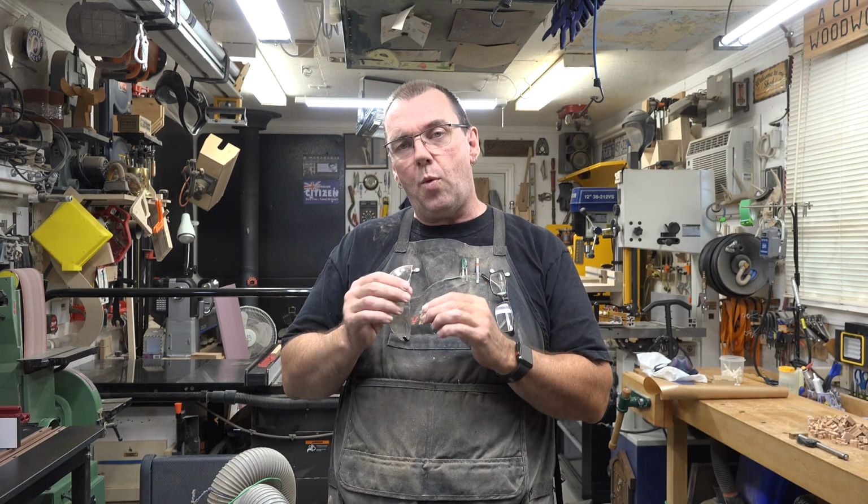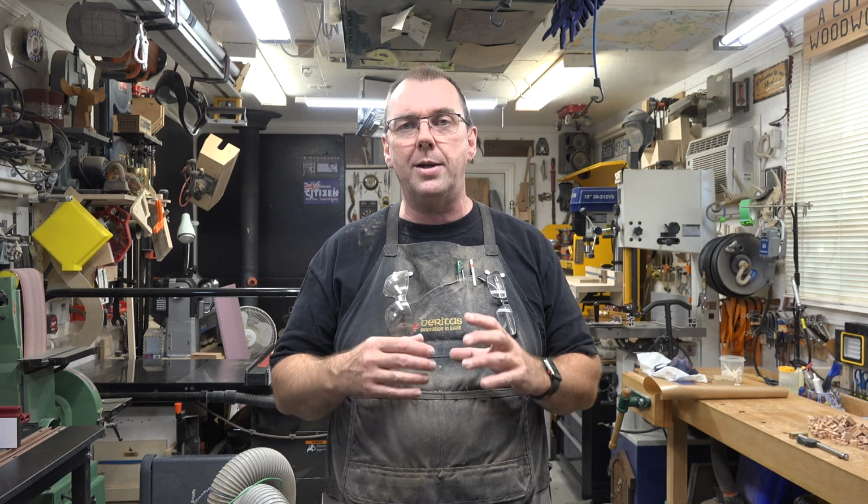Guys, there are many different variations that you could do with this project. What if you tilted your blade by 1 or 2 degrees? That way, as you're cutting all the pieces off kilter like that, they can't slide either way together. They can only go together one way because it will create a tapered hole or a tapered tongue or a tapered pocket, whatever you want to call the puzzle pieces. But they will only go together one way, which would add even another dimension to the challenge of it.